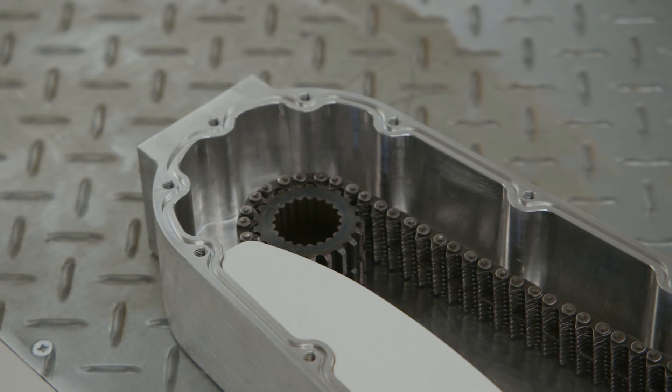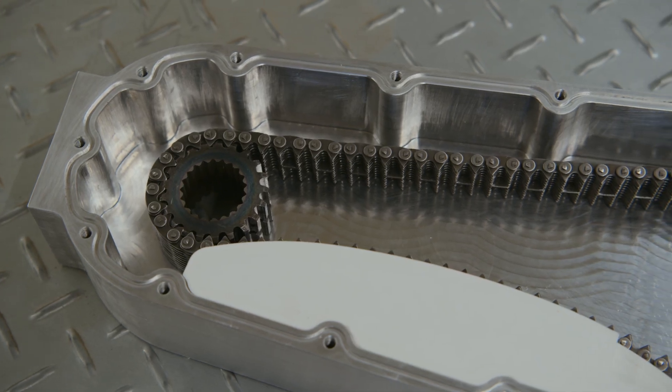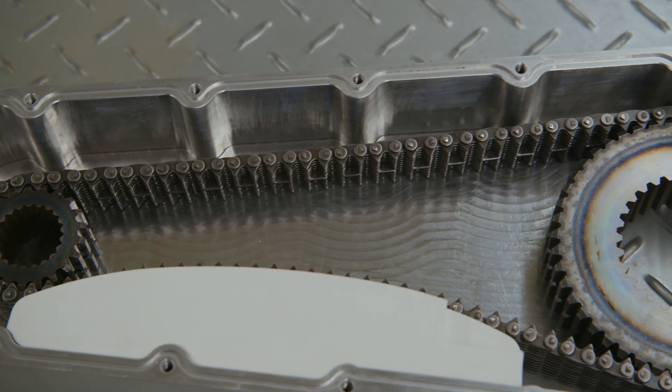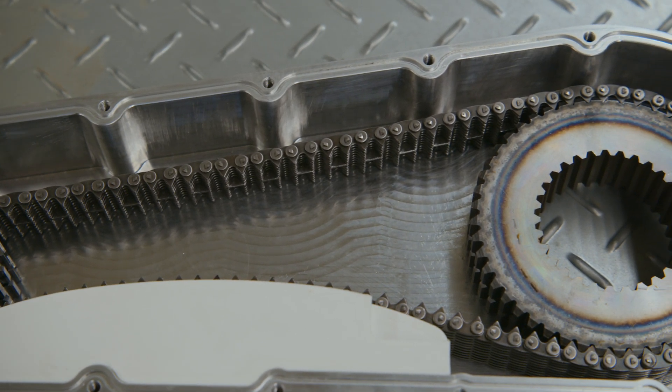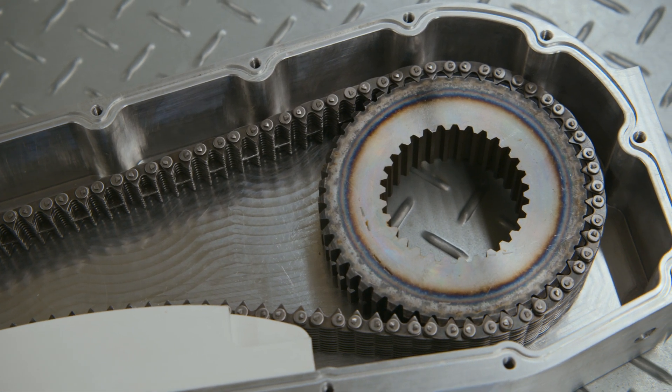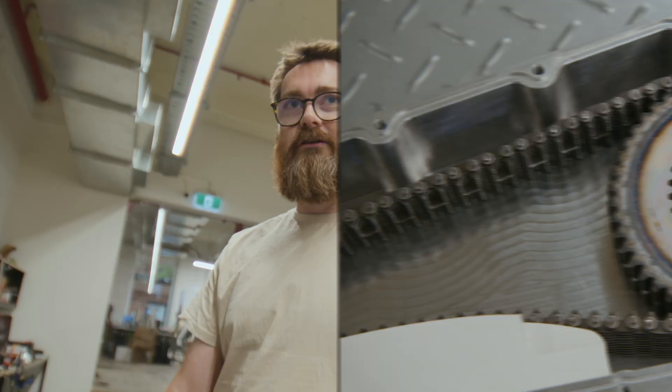It's not a huge amount of stretch, but this has been installed in the car for several weeks — not a huge number of kilometres, but it has done some work. We've put full load, 1000 newton-metres through the motor and through this system and it's not degraded. We've changed the oil a couple of times to see if there were any particles of plastic in the oil and that's all come back clean.